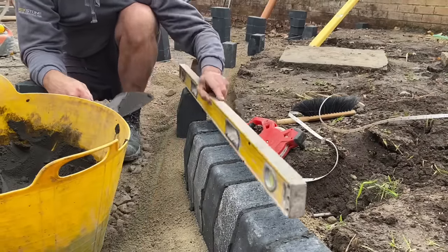Okay, so to explain what we're doing here, we are putting an ACO across the front here to catch the water, to divert it back and drain it within the property. The reason why we're doing that is because a law came in 2007 to help prevent all the flooding that's going on around the country. So the idea is the water that lands within your property, anything over 5 meters, it should be draining into the ground below. So it doesn't apply to anything permeable, like gravel or permeable block or resin, as long as it's got a permeable base and the water can go through.